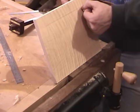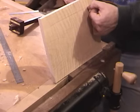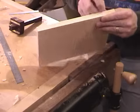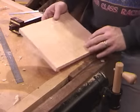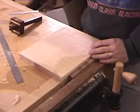So you want to basically decrease the depth of the field, and then once I have that, I'll just connect from this point up here at the base of the fillet to the scribe line that I put from the back, this short offset from the back, and just connect those two lines with my shoulder plane. That will work really well.